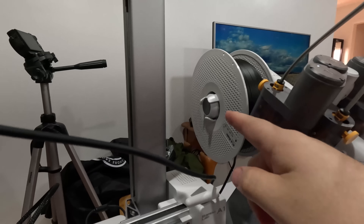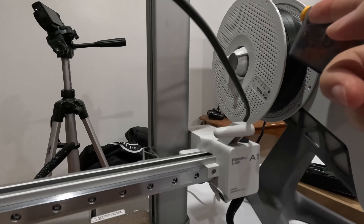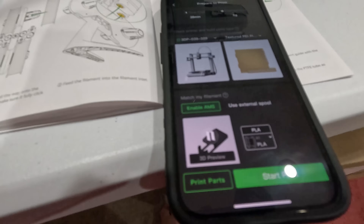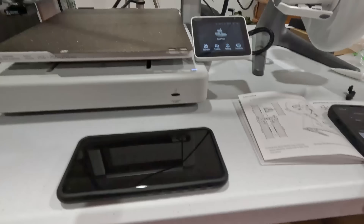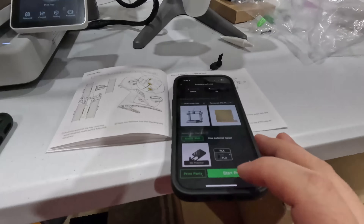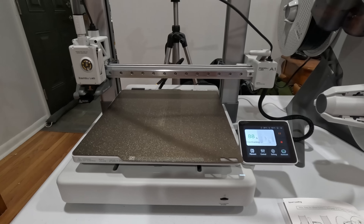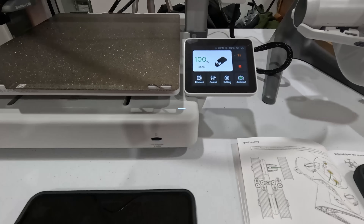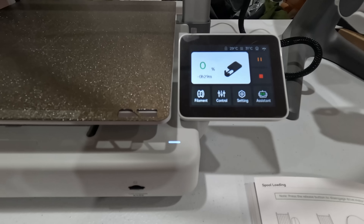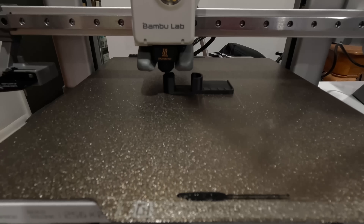I put a filament spool on — you just slide the spool on, push the button, there's a funnel underneath, you feed the filament up through it, and once it gets so far it just automatically starts feeding. The app recognizes the spool because of the NFC on it and knows where it's at. I'm going to print a poop deflector — it's real simple — and then later we'll make a poop bucket. Pressing start print now; it's downloading to the machine, unzipping, and it says 28 minutes.